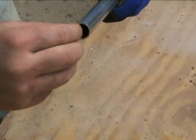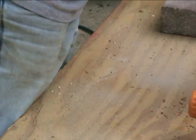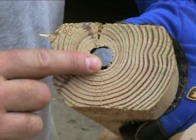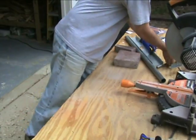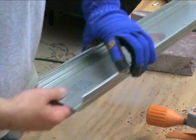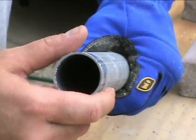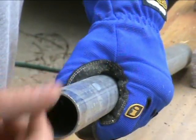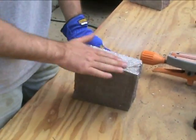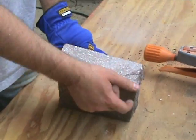The conduit — there are tiny little burrs but not bad, you can clean that up easily, and it cut right through with no problem. We cut through a piece of landscape timber with a piece of rebar in it — no problem at all. The stud came out very nice with very little burrs. The inch-and-a-quarter pipe we cut through in about five seconds; it wasn't hot and I could work with the material right away. The landscaping stone for a retaining wall — about two-and-a-half inches thick — we put the diamond blade on and it cut right through, no problems.